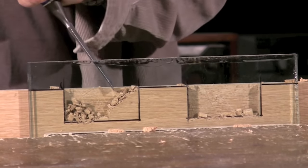Both methods work and they work perfectly. I think this is the way I would chop a mortise. That's our mortise holes cut. I'm surprised — this side feels very smooth, and the traditional mortise chisel side is not as even. So I got a more even finish with the bevel edge chisel. I just recommend that you try this method, set yourself up just like I did without the glass, cut your own mortise, see what you feel — but follow the method exactly and see how it goes for you.